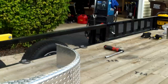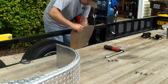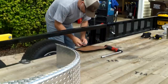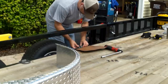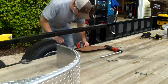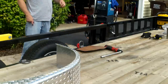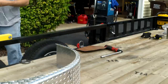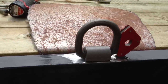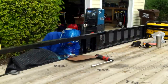I still think I got some good welds going. I'm lining it all up right on the areas we grinded. Here's my great idea: we're going to put a piece of steel sheeting between there to protect the wood from getting burned when welding — they say welding is hotter than the sun, so being next to wood is not a good idea. We're also using a magnet from Harbor Freight to hold up the D-ring while we tack it in position.